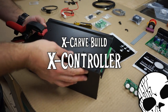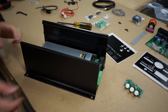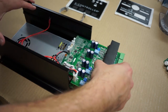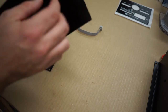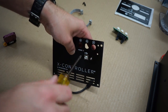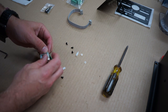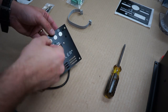The controller is essentially the circuit board, the power supply, and all the various electrical components that make the magic happen. This thing went together very easily. When I received the circuit board there was a broken piece, but props to Inventables — I contacted their support and they sent me a new one the next day, no questions asked. I was really happy that their support was so easy to work with and super fast and responsive. I haven't had to use the big red button of doom yet, but I'm glad it's there — it's basically an emergency switch that stops everything if something goes horribly wrong. There's a USB plug in the back that hooks up to your computer, and a little button panel with pause, stop, and cancel buttons. The PCB has nylon spacers so you can push it through and install it to the front panel using small button head screws.